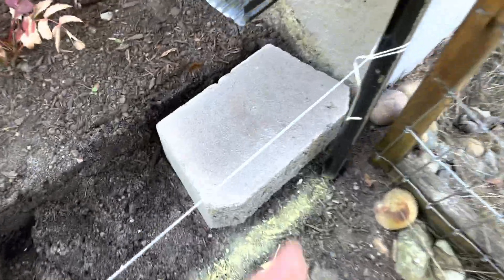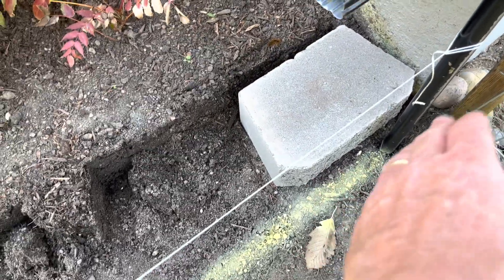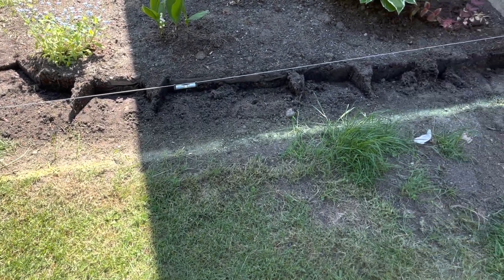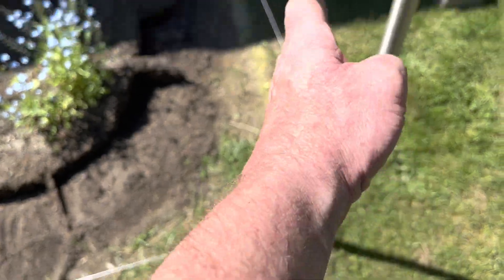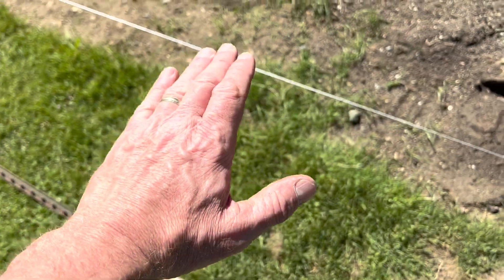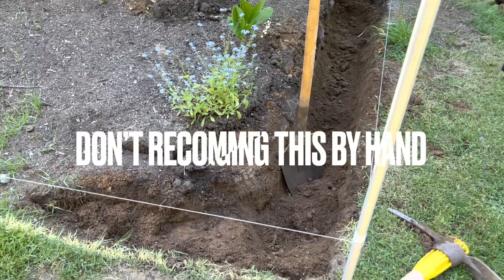This kind of illustrates what I'm after — I've got to dig it all out and fill it in. I want this to be right in line with the foundation, so I'm going to stay right in front of that line and dig it out all the way. This line is just for digging, not necessarily for level. The slope goes up that way, so at some point it's just going to go right into the hill and stop.